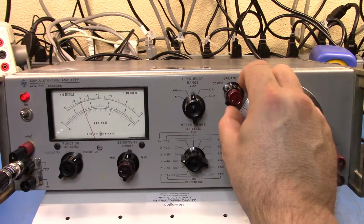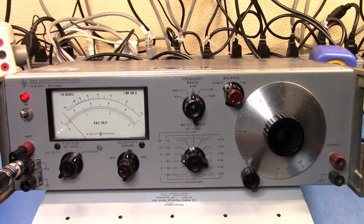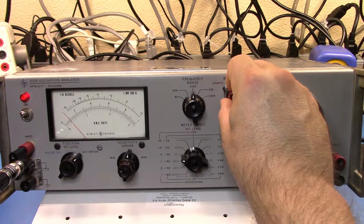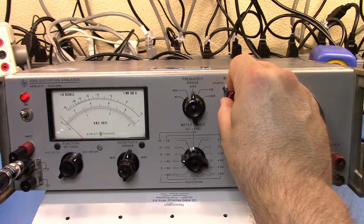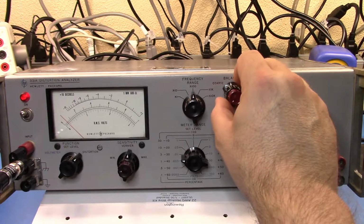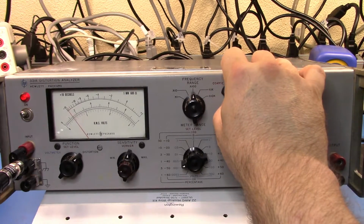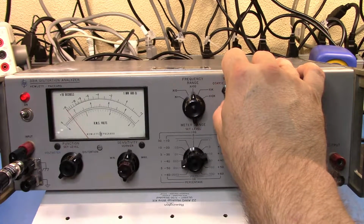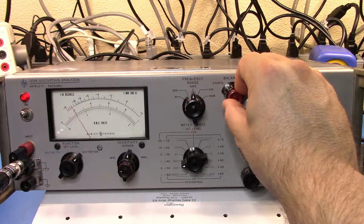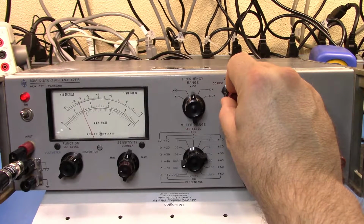You saw what happened there. These potentiometers get dirty, and they jump around, and the carbon wears off, and so on. And so you saw that this guy sort of stopped once I started getting down around there. It's very noisy. And so if I come down again, now maybe I can try with the... no. Let's see if I can.